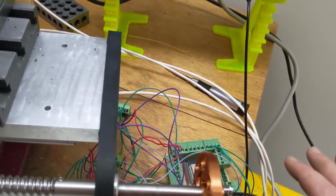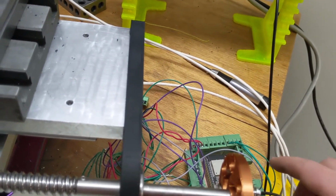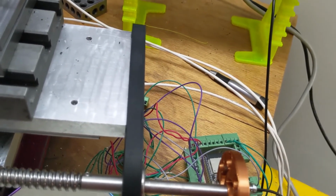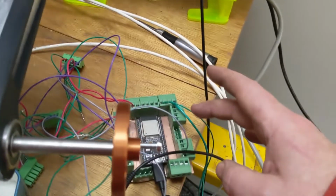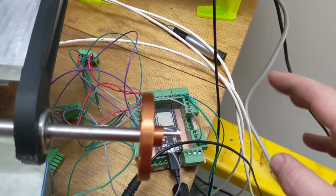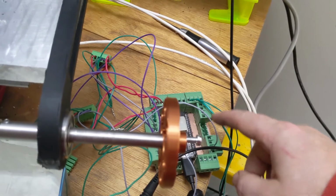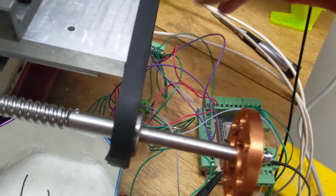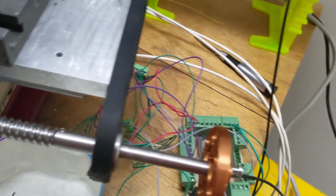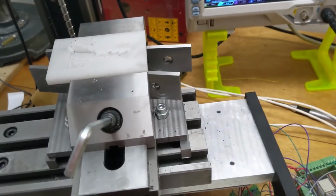As soon as I turned on the limit switch monitoring, as an input, everything was an output. And as soon as the ESP32 tried to do any input, that's when all the noise became a monstrous problem. So, I'm going to go ahead and reconnect the limit switches, and I guess try to figure out the right way to wire these up. At this point I want to keep this. I probably don't even need to do it anymore now that I connected this, but anyway, I want to keep them physically isolated.